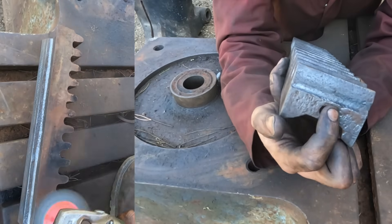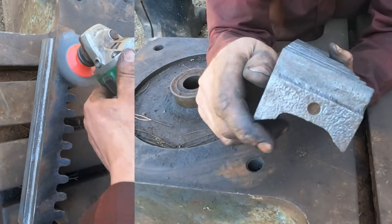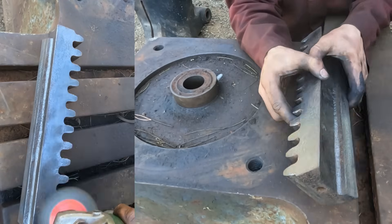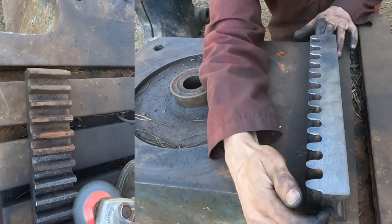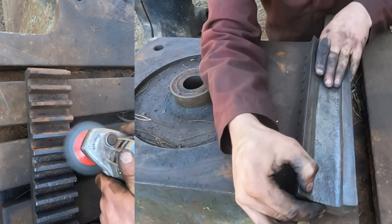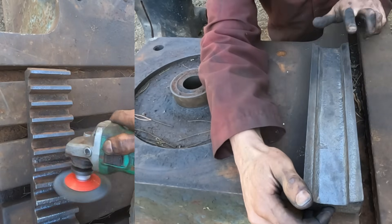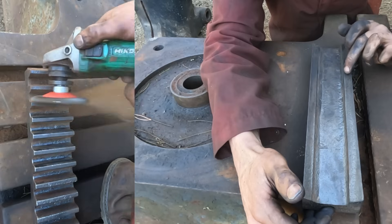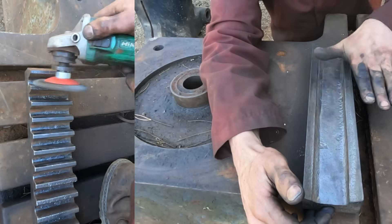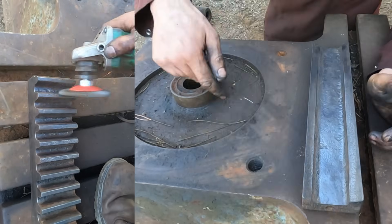Interestingly there are these fixture holes — one in each end — which have been drilled and will have been used as fixture points to clamp it down to a machine table. So to the planer, and also to a lathe saddle or a horizontal borer, which is how they would have cut this radius in the back of it. We can see machine lines just radially there. It's obviously offset slightly because this rack is off at a tangent from the main column.